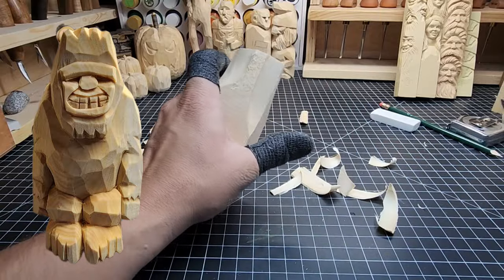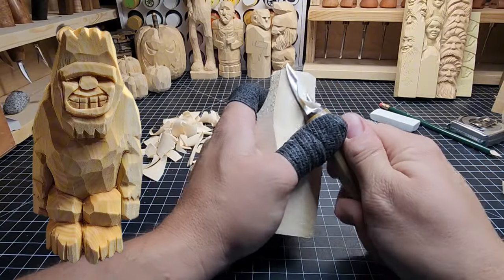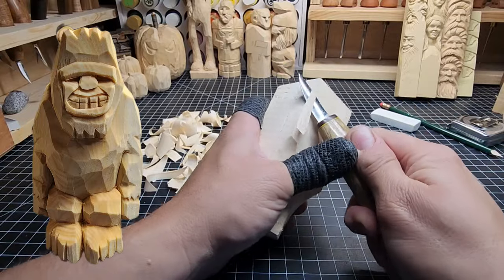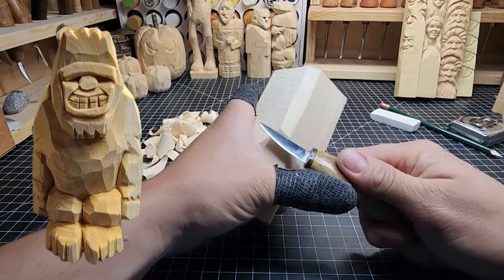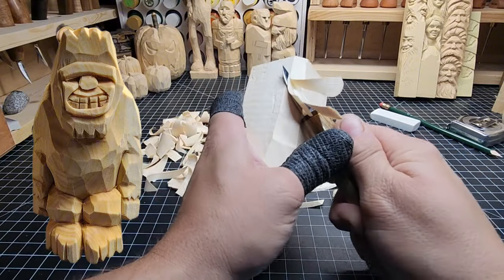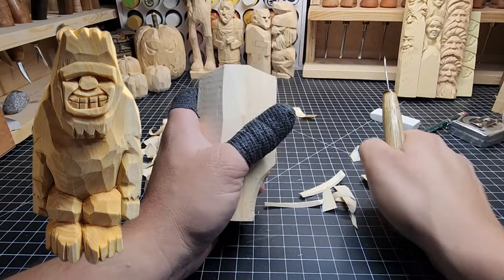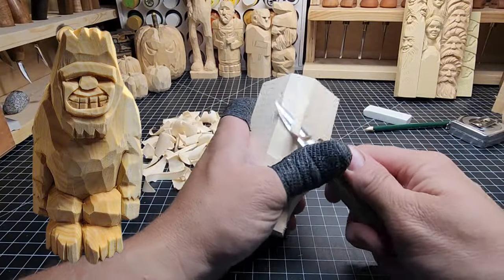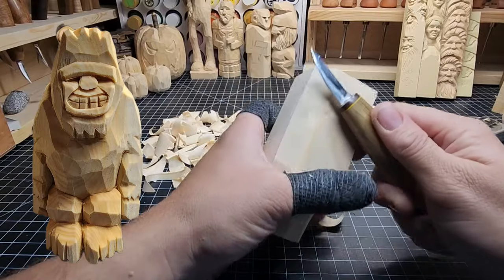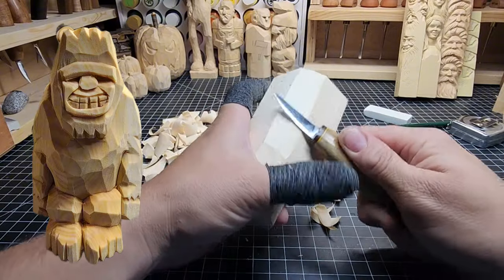Working on the back here, taking off a lot of the wood to bring that back side in. We're carving out of corners so we're removing maybe half an inch. I like to start in the middle and work my way to the bottom, then start in the middle and work to the top - because if you try to start all the way at the top it's hard to hold and manage. If the wood is tearing a little bit, try changing direction. Remember to keep in mind the wood grain - if it starts to bite in and pull your blade deeper, that's the wood grain and you need to go the opposite direction.